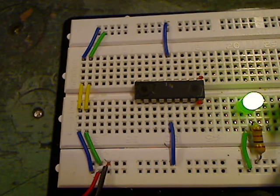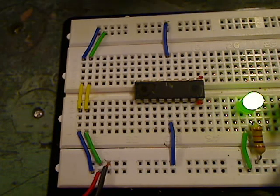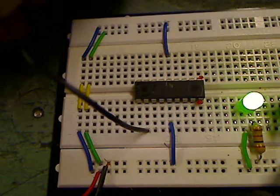I can tell that this wire right here goes to the base leg, or what they have labeled as A, and A is serial out. Looking further at the schematic, I can see that serial out doesn't require any resistor whatsoever — it just goes right to the serial out pin. The serial out pin is actually C.3, or the second pin down on this side, and I'm just going to put that right in there. Now I've got one done.